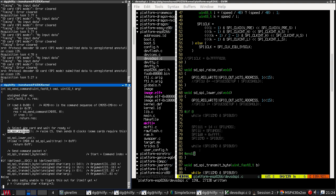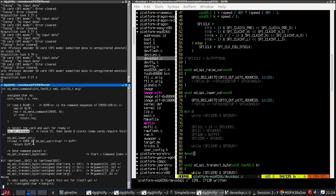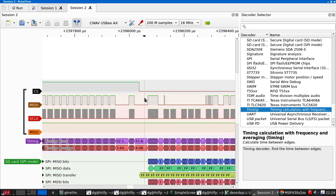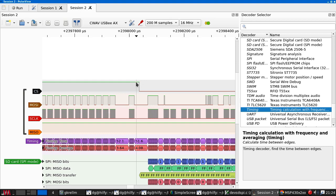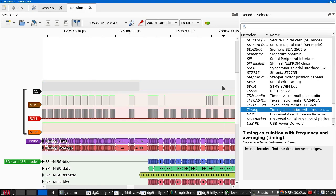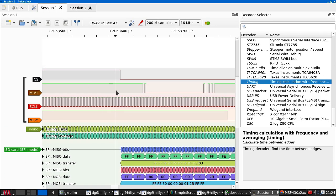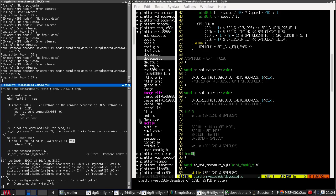so we raise CS, where CS was already raised. This is happening in this gap here. We send 8 clocks, which is this one here. We lower CS, which happens there. And then we get this. If it's not a command 0, then wait for a FF byte. That, I think, is what's happening here on the MSP430. But it's no longer happening here, so...